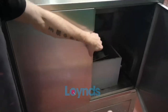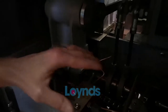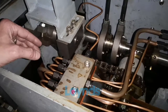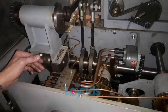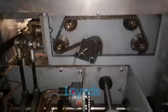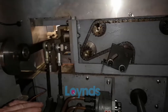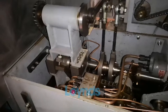On the maintenance side, this is the main gearbox which has an oil pump circulating around all the moving parts. It's filled with MP150 or equivalent gear oil and it's a sealed sump, so it probably just wants checking every 12 months to make sure the oil level is still high enough. All the driving gears you can see are greased up — check them regularly to make sure they've got plenty of grease on any moving parts.